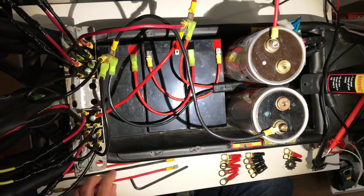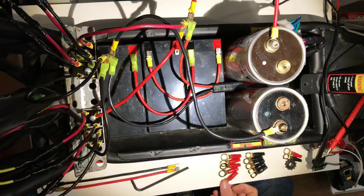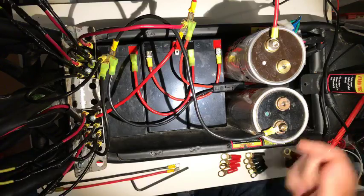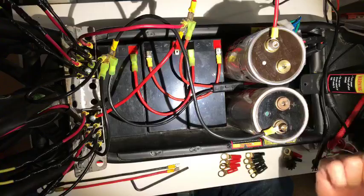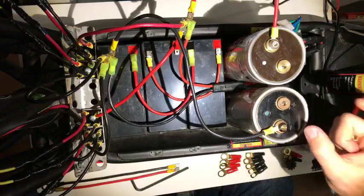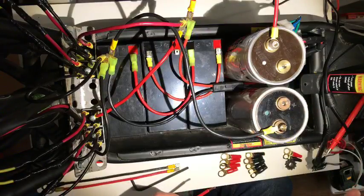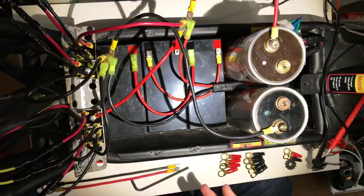So the way we're going to charge this is just by turning the alternators with a drill. And you said that's going to help not to weld. Oh yeah, because if we charge these, like let's say we just touch a fully charged battery to these, when we were doing that in the past, it was throwing like an arc weld. Because they just pull all the power at once. It was sparking. But since we're going to charge them slowly with these alternators, as they turn from a low RPM, they produce more and more volts. Then it won't do that.